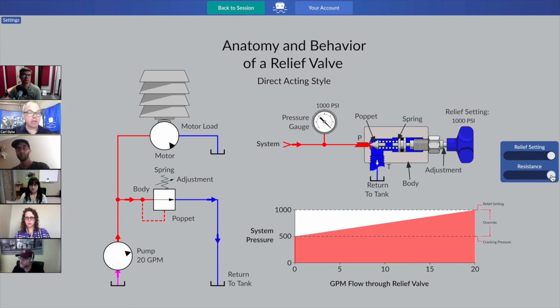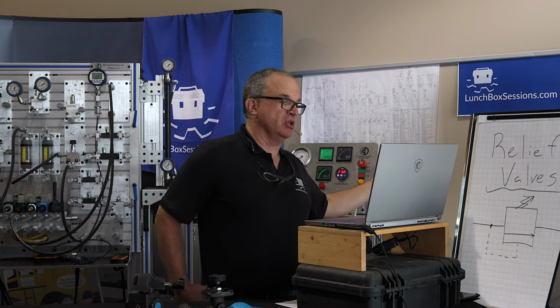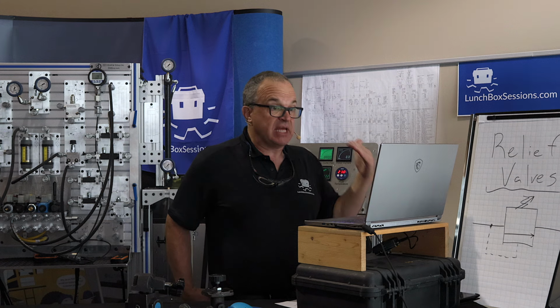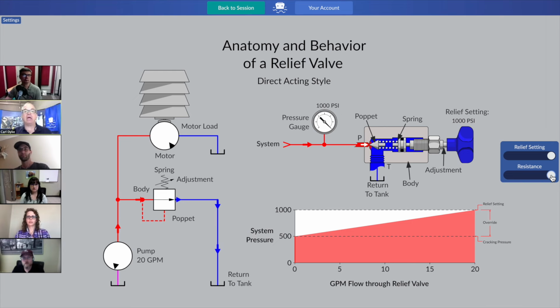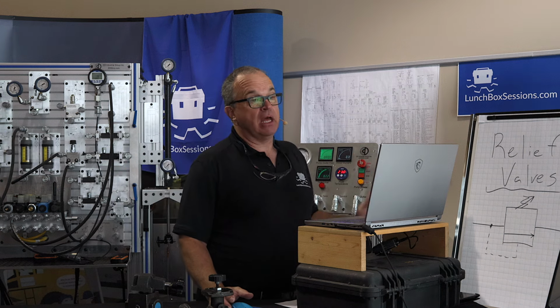That's correct. As we stated earlier, once you are confident that all flow has ceased everywhere else in the hydraulic system and flow is only passing through the relief valve, have we discovered what the true full flow setting of our relief valve is. That's the setting at which it will protect the system from coming apart when all flow paths are blocked except for the all-important relief valve, which is ready to jump into action, connected directly to tank.